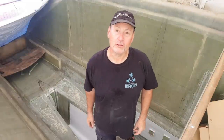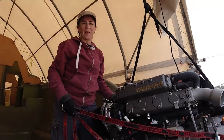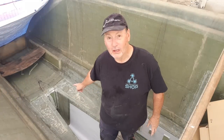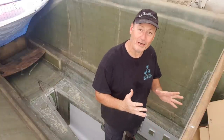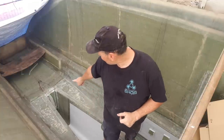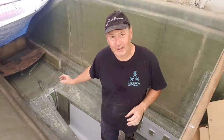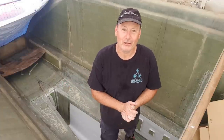I've flow coated out all the bilges here to allow for waterproofing and for the flow of water down to my bilge pumps. I've had the motors in and out basically to get the alignment correct. I have my positions for them on the bearers here. I also have the angle of exit at seven degrees — we initially thought it was eight but it's worked out to be seven. I'll discuss later why they have to be at seven degrees, but it is a shaft drive boat. This week I've been working on the deadwood section, increasing the thickness and rigidity of that rear skeg down there where the shaft is going to ultimately exit the boat.